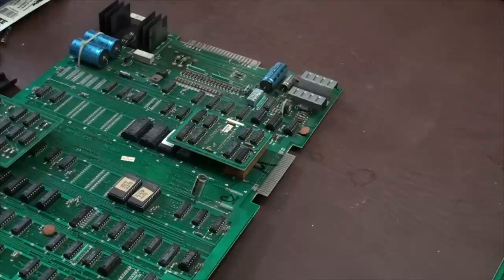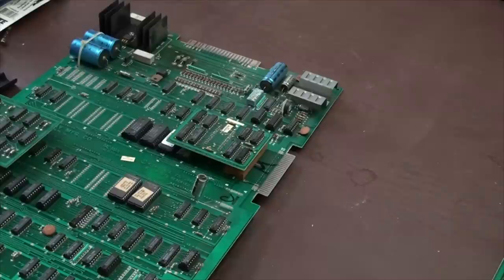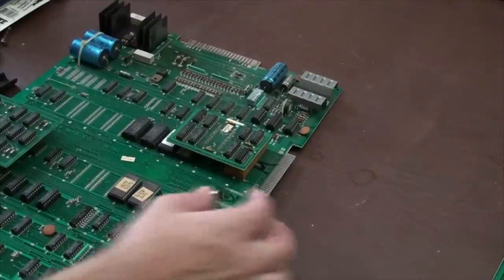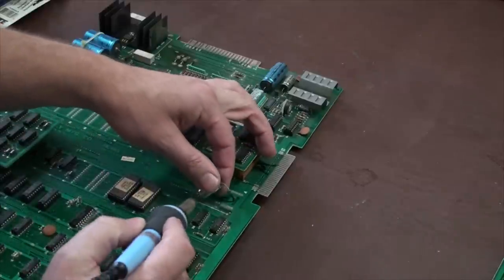If it says 470, now there's tolerances, right? Generally 10% is about as much as you want to go. But depending on the circuit, you can play around with these numbers a little bit more. But when you're dealing with a PCB board, you want these things to be as accurate as possible. You need those tolerances to be even tighter. And when you buy new parts, buy quality parts. Don't buy crap, because the crap ones won't last as long and their tolerances are much worse.